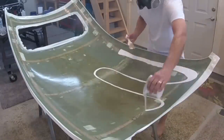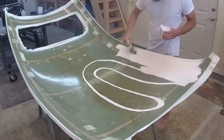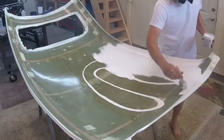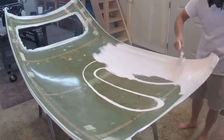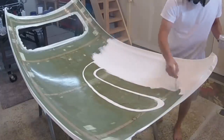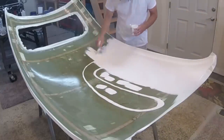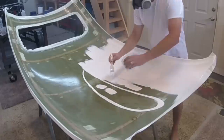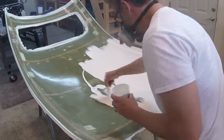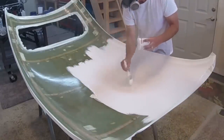Here I am putting on the first layer of gel coat. I ended up going with two layers, just mixing it up and lathering it on with a brush — relatively thick. This stuff by itself is kind of a thick paste. I'm trying to keep it thick but not too thick, because if it's too thick it'll shrink and crack a little bit. This stuff is the smelliest stuff I've ever come across. I'm wearing a respirator and glasses — I can't smell it with the mask, but I can still feel the fumes in my eyes. It's incredibly smelly and kind of difficult to work with.